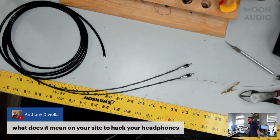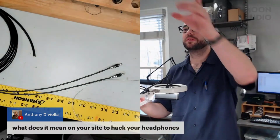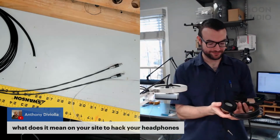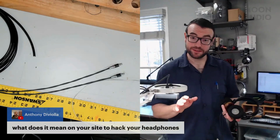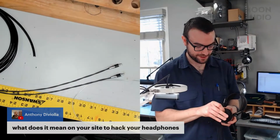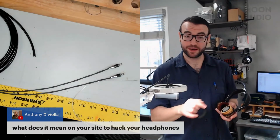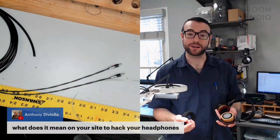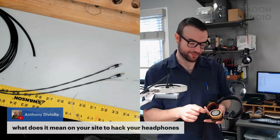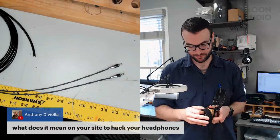All right, I'm back. Got a little bit of an example here that Daryl can talk about. I went and grabbed the Grado RS1X. As I was saying, Grado is still a big example of Hack Your Headphones. We're authorized by Grado and trained by Grado to do this. So we'll give a brief overview of what you can do. The drivers are glued in. We've been taught how to properly pop them out, and that exposes the back of the driver where we can put our cable in, secure it so you can't pull it out and break the solder joint. Resolder to the driver, close it back up, glue it back up. It's good to go. And then it has your favorite Dragon cable.